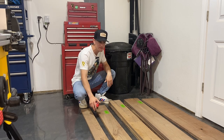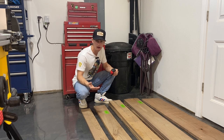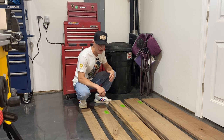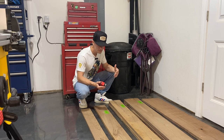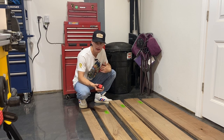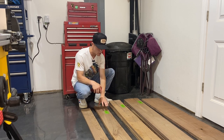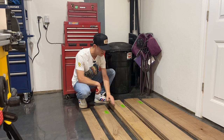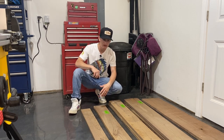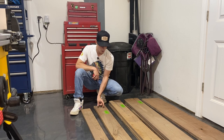There are a couple of ways around the jointer width limitation. I'm going to go the safer route and cut my boards down so the jointer can accommodate them. I'm starting with my 1x6x8. As you can see, I've labeled all my pieces with green frog tape showing the dimension each piece needs to end up at. This 1x6x8 needs to be cut into two one-and-a-half inch pieces and one two-and-a-quarter inch piece — totaling about 5 and a quarter inches from a board that's about 6 and a quarter inches wide.